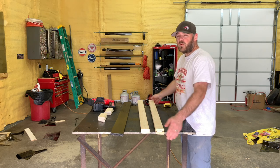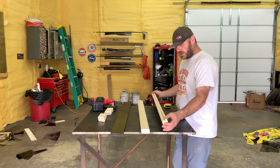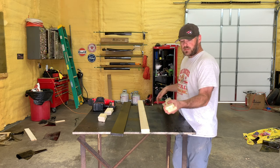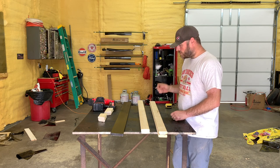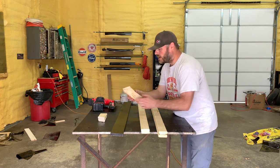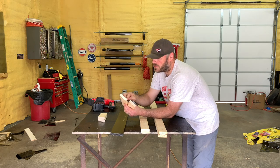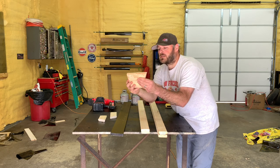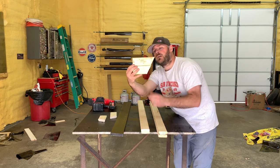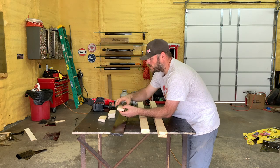My windows are like 43 and a half inches, so I cut these at 43 and a half inches. I built some shutters for our house, and I had these 1x2s left over. So I cut these at 30 degrees. Now, you can do these flat — you don't have to put this angle on them, but I'll do my box kind of like that on the front. It kind of makes it look a little bit better, but you can do these straight.